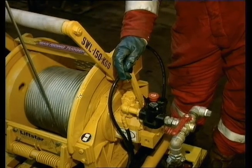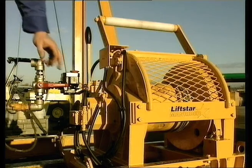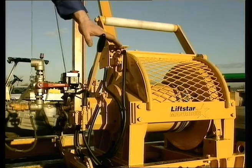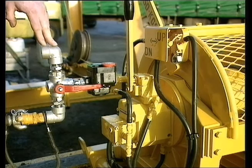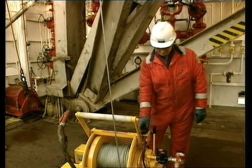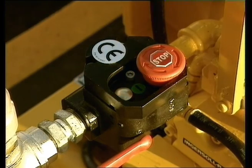The first safety feature is the emergency stop button. This is fitted to the winch unit itself and the remote control PHS pilot pendant if used. Whilst the unit has an overload protection device that will sense any increase in pressure on the motor and automatically immobilise the winch, the manual emergency stop button will cut the air supply and totally immobilise the winch. If the emergency stop button has been operated, you'll have to reset the winch before further work can commence. Twist the button clockwise to release it and press the on button below to return air to the winch, thus making the winch operational again.